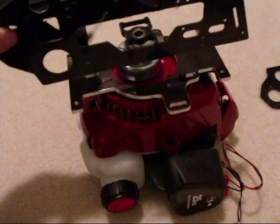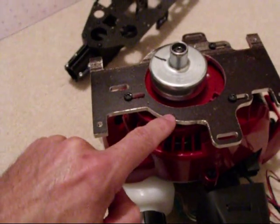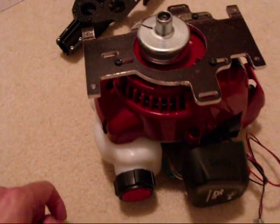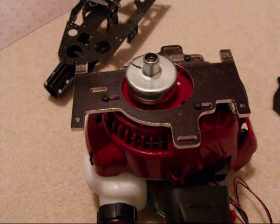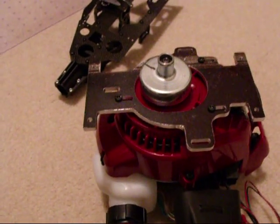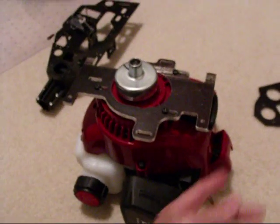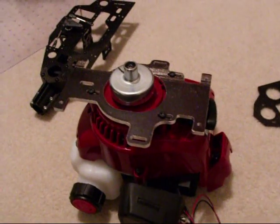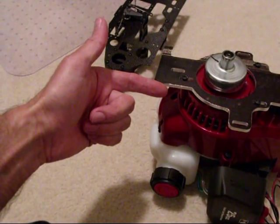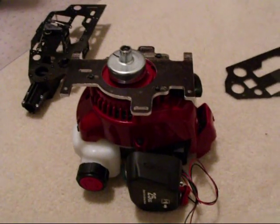The helicopter body will mount on top and I've still got to make the brackets for that — they'll come down and mount into these holes. There are a couple of holes there for mounting the body too. In the next video I'll be working on the power transmission system and probably the body mounting brackets — that's really about all that's left, not much further to go. This will be the front of the helicopter; the pull rope will come right out the front. These four holes on the tabs are where the skids will mount to — the skids will mount under the corners, come out, come down, and the motor will just be cradled amongst all that.